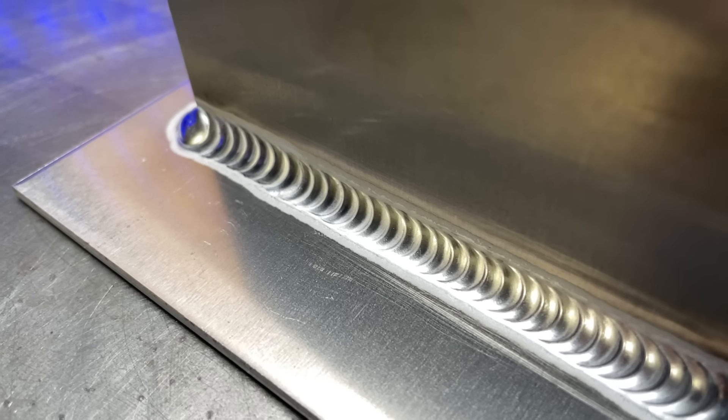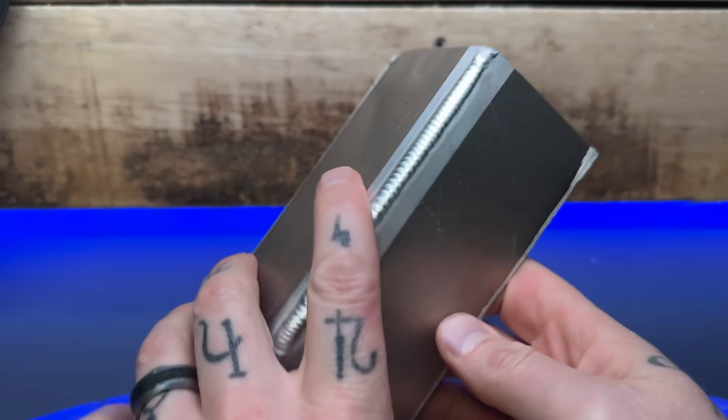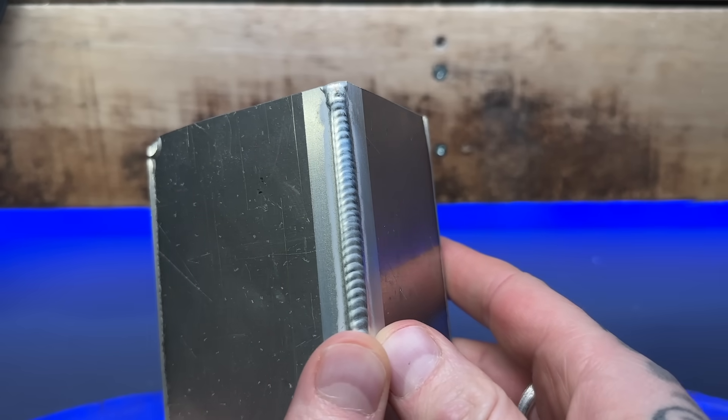As long as you aren't getting into amperage that's too high in relation to the material thickness, you're going to be able to hang out a little bit longer and afford to spend some time to allow things to properly establish. This is especially important with joints like a fillet joint - those ones in particular are extremely tough and grumpy to get started. Spending a little bit of extra time to let things properly develop before moving is certainly worth it. And doing some really thin stuff like this outside corner, same thing - a little bit of filler right off the start and controlling the heat. The philosophy is that all the hard work is done at the beginning. Once you start moving, all that's left is to babysit what you started and established.